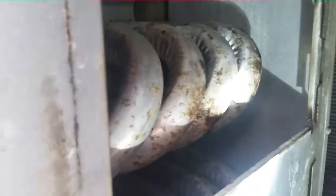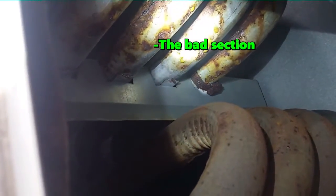You can see the little heat exchanger right here is looking kind of rough. Let me look down at the bottom — it's rough looking for sure. Let me get a light in there and see if I can see any pinprick holes coming through. I put the light in there and tried to peep around for pinprick leaks from the inside with a scope from the outside. I put the light on the other side — pretty good visual examination shows no holes, just a whole bunch of holes waiting to happen basically.